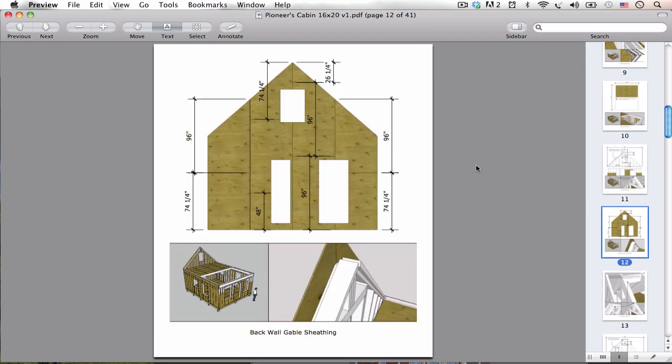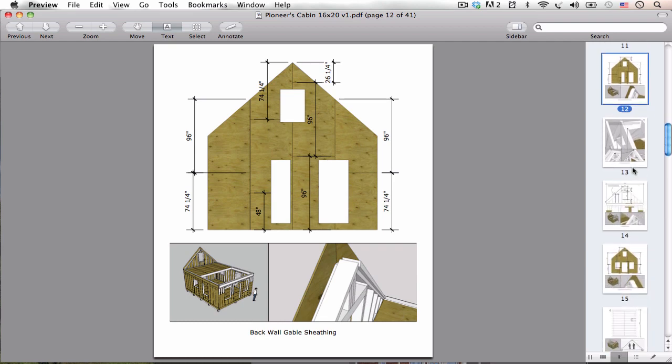I just showed you in the video walkthrough this strange puzzle piece thing that's going on with the plywood. But then it starts to make sense when you realize that there are lots of 8-foot pieces being used here, and the reason some of them are cut is really to optimize the plywood and yet still stagger seams, making it stronger.